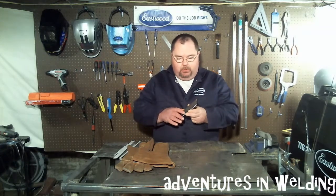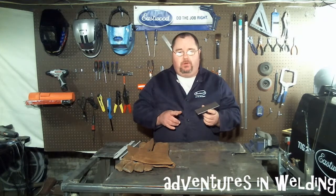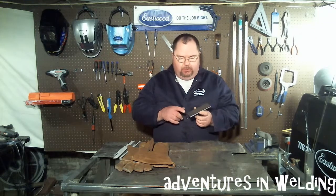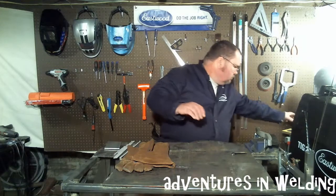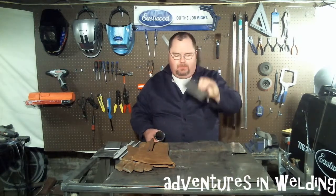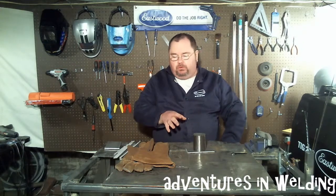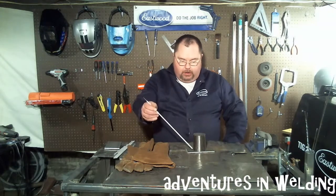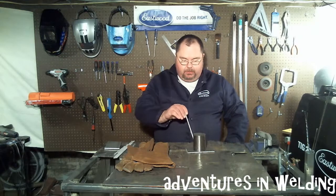We've got about an eighth-inch piece of mild steel, and the first thing you're going to learn is how to run a bead. We're going to skip that and assume you know how — so I'm going to run a pad of beads here, speed it up so you don't have to watch everything, and show you what your instructor is going to want it to look like. After that, we'll do a little fit-up and weld using the same piece of mild steel and a little bit of 2-inch schedule 40 pipe, kind of like making a flange. That'll give you a real challenge because rod angle is very important as you make your way around the pipe.